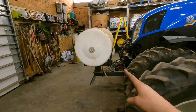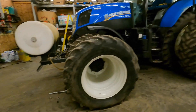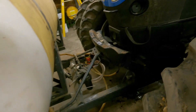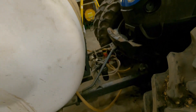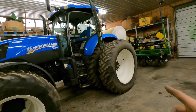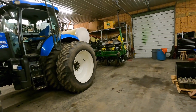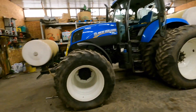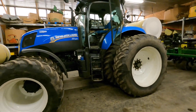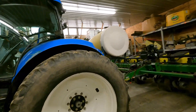As you can see, we've got the front tank on, rear tank on, planter hooked up. All I got to do now is run some of these fertilizer lines back to the planter, make a couple electrical connections, throw the monitors in, get all the hydraulics hooked up and that's pretty much all I can do. We have a guy coming out tomorrow that knows way more than me and he's going to set up all our software. Let me just go over our fertilizer setup.